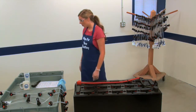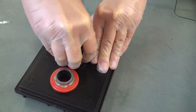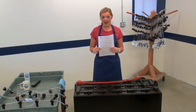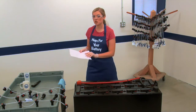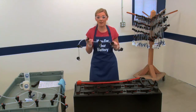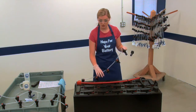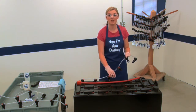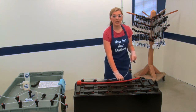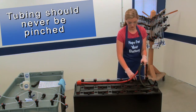If your battery requires an adapter for a 35 millimeter opening, insert the adapter into the vent well before you install the valve. Using the drawing provided, lay the partially assembled string of valves — the valves that are connected together by the tubing — on top of the battery, and gently insert each valve into the vent well without snapping the valves completely into place. Be sure to route the tubing underneath the cables whenever possible. They should never be pinched.